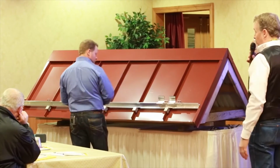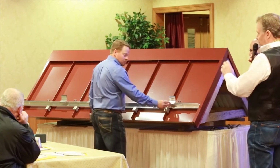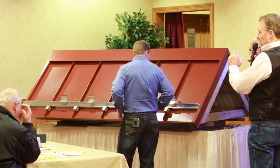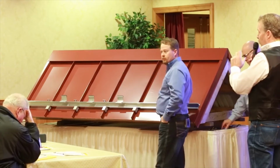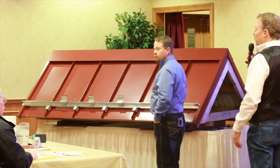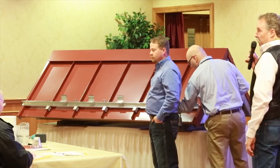My preference as a rule is to avoid the expenditure of using them all over the roof. That clip is only restraining 2 inches or so of snow. You don't need them on every single row, so it's quite okay just to use them on the last row, on the bottom row. Some users, some specifiers want them, more is better, so they want them on every row.